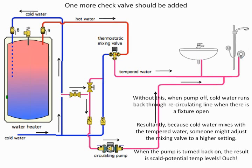And then the other question along that line is, what if they're only using one tank as both the solar tank and the domestic water heater? If they put a recirc on that, now they're blending that tank and they don't have the stratification and they start to lose some of their solar fraction. Right, that's mixed up. So now you're going into a whole new ball game there.